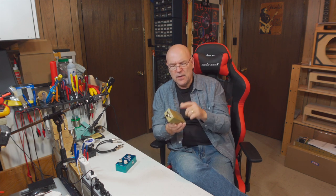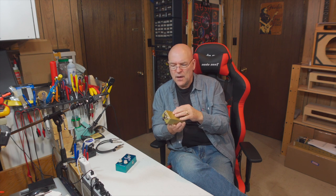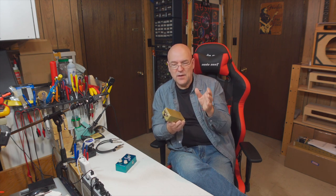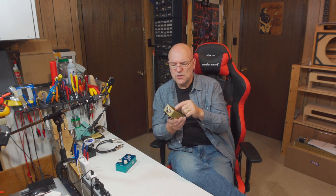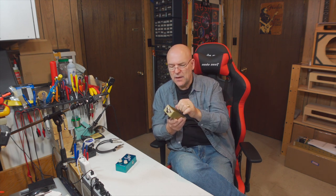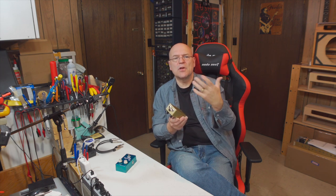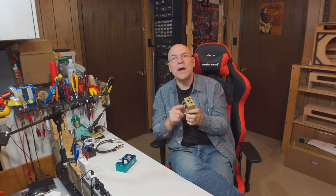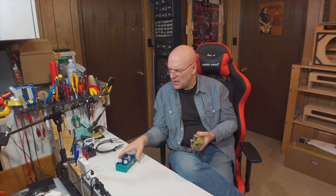That's another point, though, when you're troubleshooting or when you're first firing up and you've got the back off of the pedal, it might be sounding good and seeming to work well. But one thing you should do is just take a chopstick or something and just wiggle the wires around to see if anything shuts off, turns on, whether you get any noise or things like that. That's how I found that loose wire on here. So that's all fixed up.